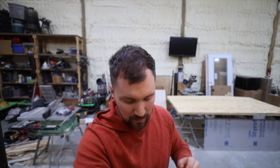We have lights. I have them all wired up all the way through the living room. I just don't have the primary power fused and connected for the living room right yet. I've still got to put it on another dimmer. What's going through my head right now is I'm trying to figure out how I can utilize a dimmer as well as a three-way switch, because we want to be able to turn at least the kitchen lights on from the front, and then turn them off from the back as well.